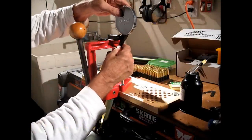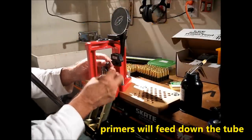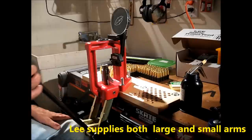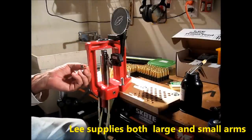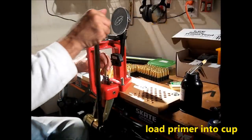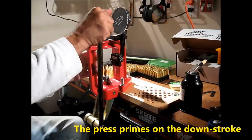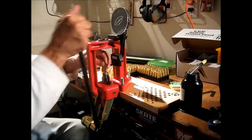Once they're in there and the top's closed, they're not going to flip on you. Just pop it right on top of the press. The primer arm comes in large and small sizes — I marked mine with an S for easy identification. Small rifle primers. Pop it in, put the shell holder on top, test the function, and you're ready to rock. Take a clean, swaged, sized, trimmed case, pop the primer in the holder, put the case in, press it in. There you go — one primed case. Make sure you've got a good snug feeling; it is putting a lot of pressure on it.